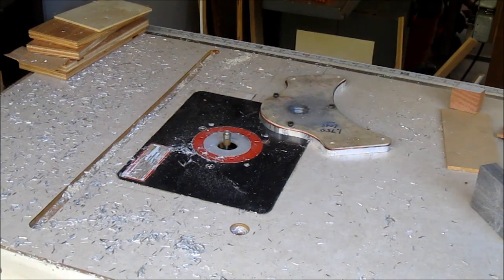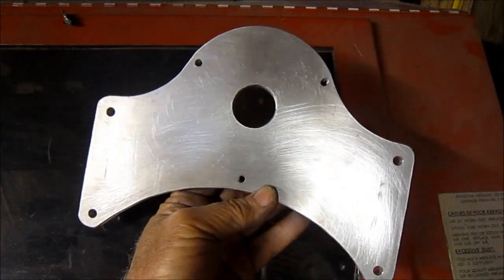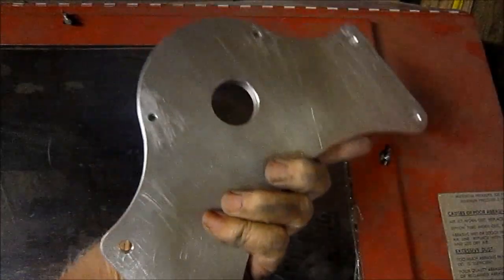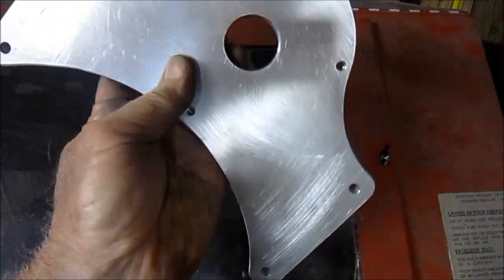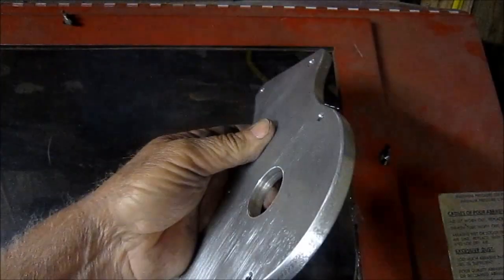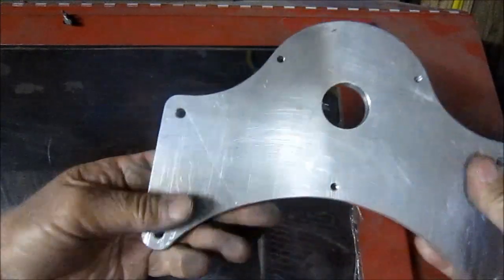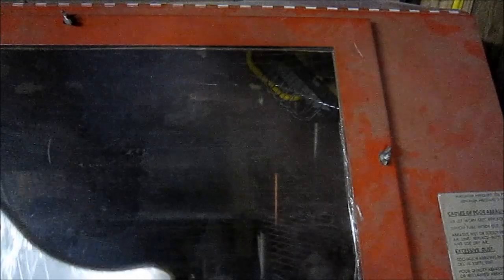You don't need to watch all of this, so I'll be back. Well, here's the plate. It's been through the router - chamfered all the holes - and it's going to visit the glass beader right now. I ended up using a round-over bit in the router also to smooth all the edges on the plate. Alright, so we'll visit the glass beader here.